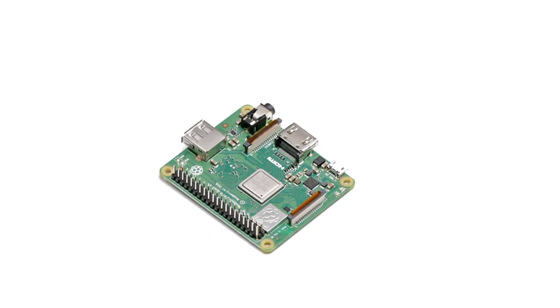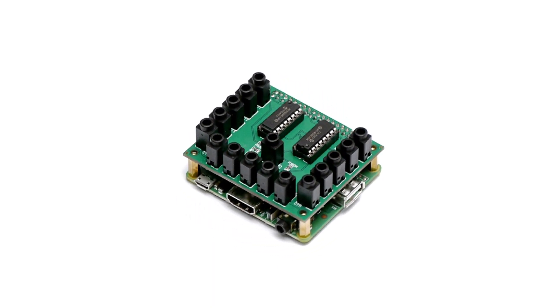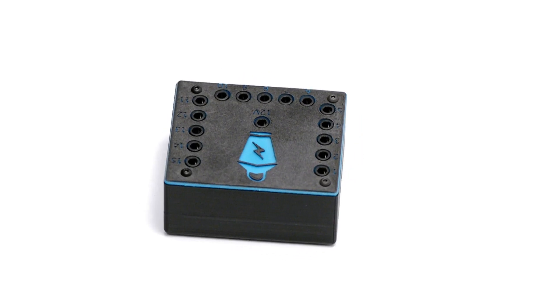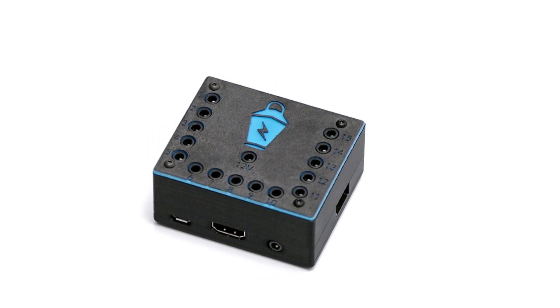I started with a Raspberry Pi 3A+, and then I added a custom PCB that allows you to connect 15 current transformers so you can monitor the power of 15 breakers in your panel all at the same time. And then I put it all in a 3D printed case. There are other ones that have tabs so you can mount it on the wall near your electrical panel.